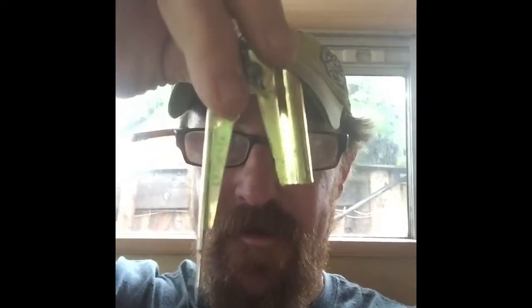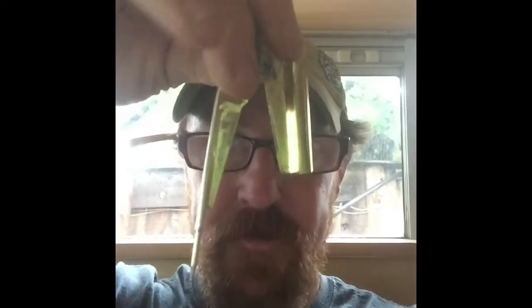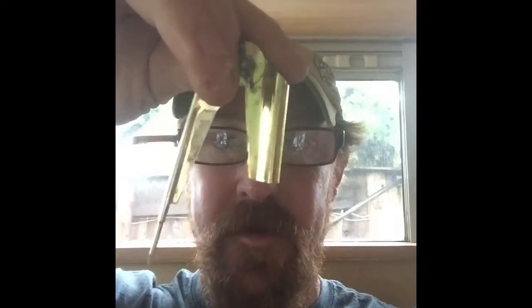The difference? This is flat on one side, whereas this isn't. If you want to hold something flat against the ceiling, guess what you're going to need? Something with a flat side. So this side right here with the point is what's going to ride on the ceiling, and then your pencil goes on this other side. So that's the actual tool you'll need. And it's actually called, believe it or not, a scribe.